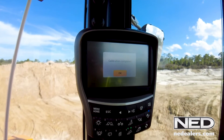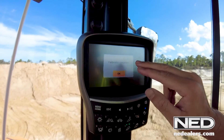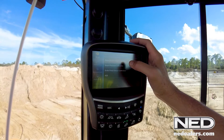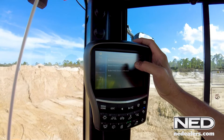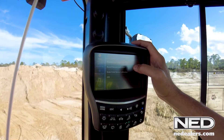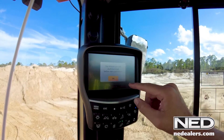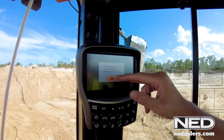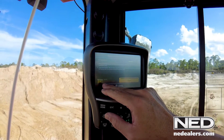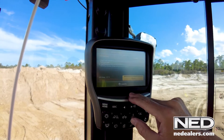And now you can see the calibration for the boom and bucket angle sensors is complete. The next calibration is the boom pressure calibration. This system uses a combination of boom pressure and the angle of the bucket and the boom to measure the weight of the load, so we have to have both fully calibrated. We've already turned the soft stop features off. We've already got a temperature that exceeds 104 degrees — our current hydraulic oil temperature is 111, so we're able to do the calibration.